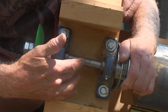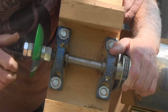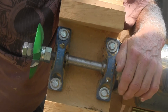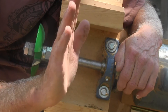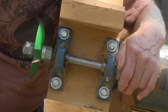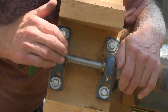The shorter you make this shaft between your pillow block bearings, the better it's going to run. A longer shaft will give you problems, especially with bigger cutters. Most cutters are balanced, but having them resharpened can knock them out of balance. At 7,000 RPM, even a hair out of balance will cause the shaft to start oscillating — you'll feel it in the machine. Once you start running stock through, it'll calm down a bit, but oscillation means a lot of wear and tear on your bearings, which is another reason to get good bearings.